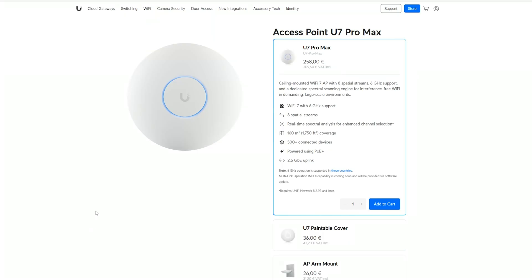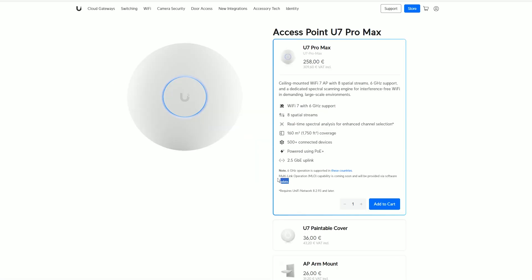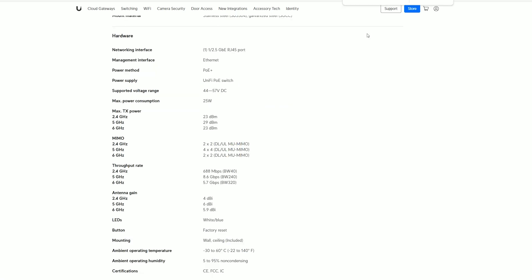Let's talk about some of the WiFi features that can be used with the U7 Pro Max. We know that there is support for the 6GHz radio and for the 320MHz channel bandwidth, which is a very nice combination, but pretty much all WiFi 7 adapters want to see multi-link operation in action. Unfortunately, we do need to wait a bit more since it seems to be more complicated than expected. Hopefully it's not going to end up just an empty promise. I also need to mention the support for MU-MIMO and OFDMA.